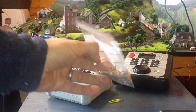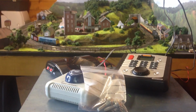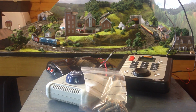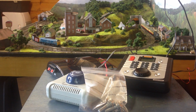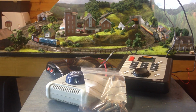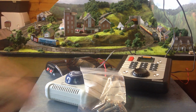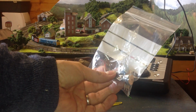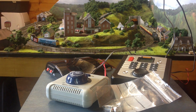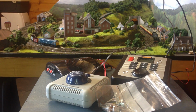So I did a bit of research and found that these little things are called potentiometers, and you can use them to vary the voltage. So I thought, brilliant, I'll wire one of those in, and looked up how to wire it in. Wired it in, switched it on, and it was fine. The lights came on really bright. Went to turn it down to lower the voltage, and lots of nice smoke came out of the potentiometer. Tried it with the other one, and exactly the same thing happened. After a lot of searching, I eventually found that you're only supposed to use these potentiometers to control another circuit, not directly in a circuit that takes a lot of power. I wouldn't have thought a few tiny little light bulbs would have been a lot of power, but apparently it's far too much power for these potentiometers, so scrap that idea.